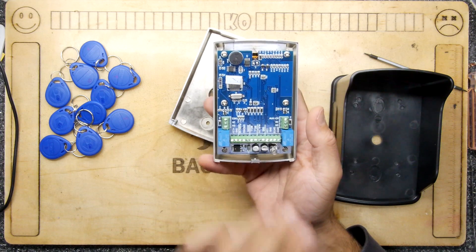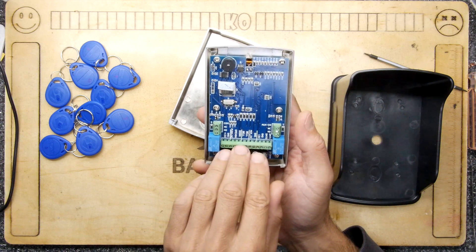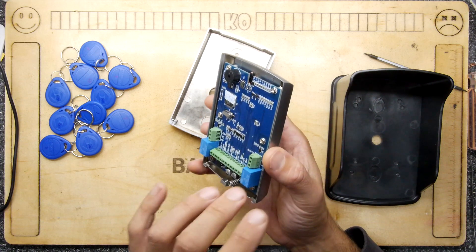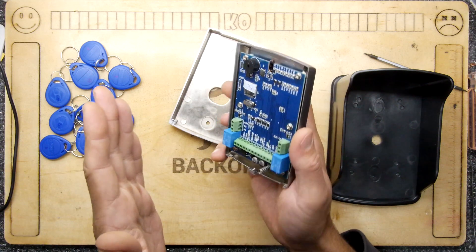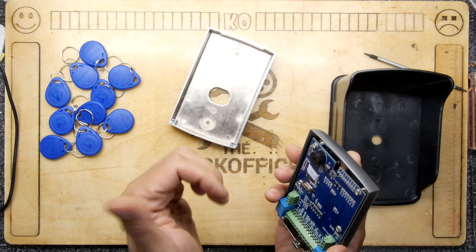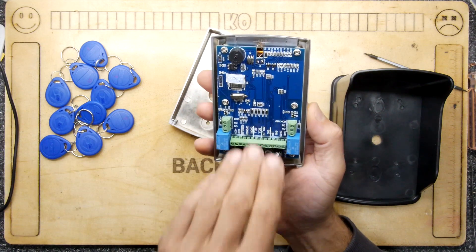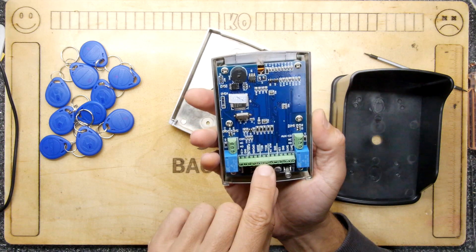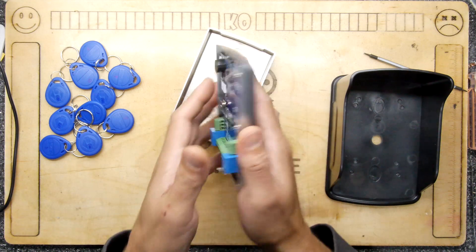If you're interested, research these because they come with a specific power adapter — a mains line adapter with a built-in timer and several power outputs designed to operate magnetic door locks: the kind that glue the door shut and the kind that operate that buzzer release. I'd always recommend going for one of those because these integrate directly with them. There is also a doorbell button on here and a doorbell output, which is probably relay-operated as well.